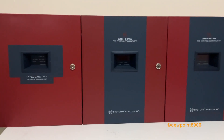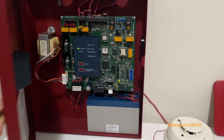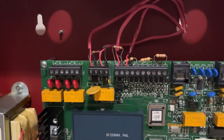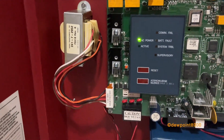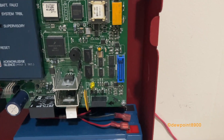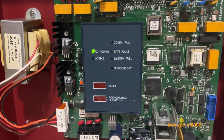Let's begin with the 411 UDAC. Here it is powered up — it's got a small circuit board. There are the four initiating zones, single circuit, and 12-volt auxiliary power which is resettable. Two relays, transformer, AC input, batteries. This blue connector here is for a Pro 411 programmer tool, and then the phone lines. The operator interface is very, very simple — just a bunch of LEDs and two buttons.